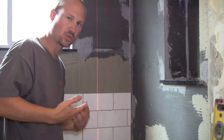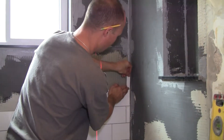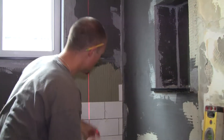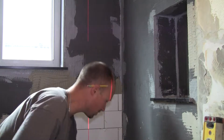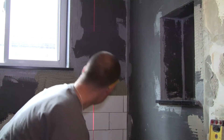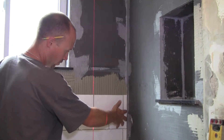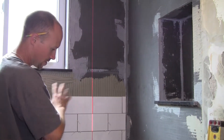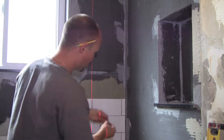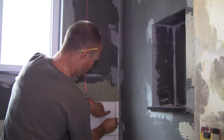When you get into larger areas you can really go as fast as you want. You can see how much faster it is to lay a few tiles and then put in spacers. Another way is to lay all of the tiles in one shot and then put in all your spacers — it can be a little confusing at times so I wouldn't recommend starting that way, but it is a valid method.